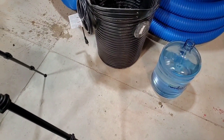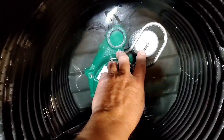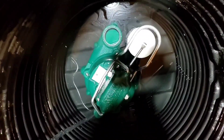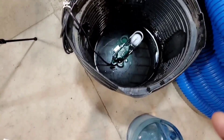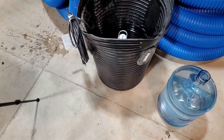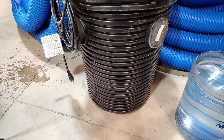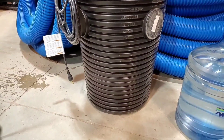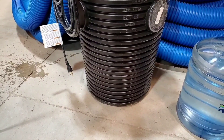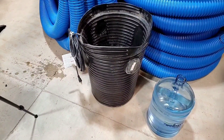This is one of those cheap basins from the big box stores — I've been warning you guys to stay away from them for a lot of reasons. By its very design, this basin tapers and is smaller at the bottom, which is why so many people put cinder blocks and bricks at the bottom to set their pump on — because it's wider up higher and will take a little more water that way. Does it reduce the cycling? It probably adds up to something, but not much.